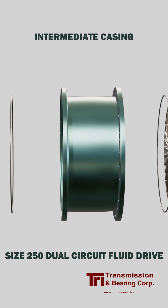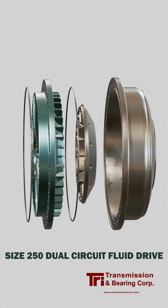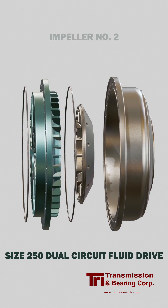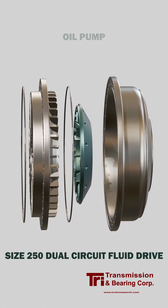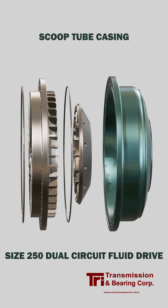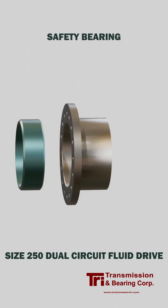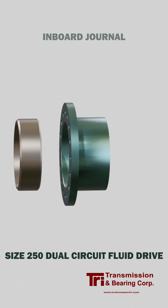The parts shown in this assembly are precisely machined and assembled with great care. The element spins at 3600 RPM and must be dynamically balanced while filled with liquid. The element is supported at both ends by tilt pad bearings, which tame the turbulence inside the rotating element.